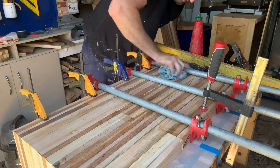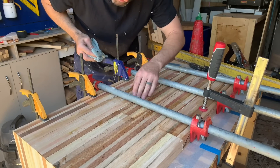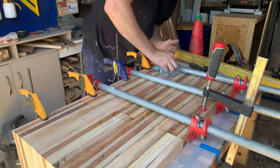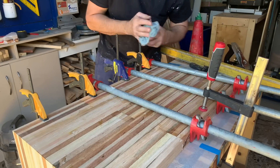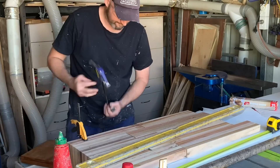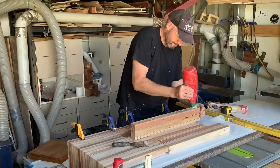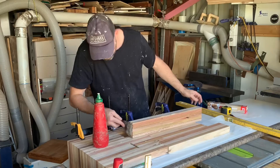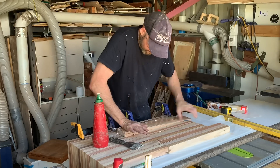There are a few lips here and there, and that's where I give it a whack with the belt sander — it's way too wide to go through a planer and I've got a waterfall on the other end. You'll also notice I don't use biscuit joints. There's so much gluing surface it's not needed. The biscuits are really for alignment — I will use them in the future for other things, but not right now.